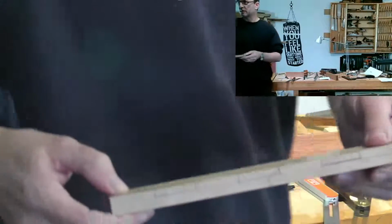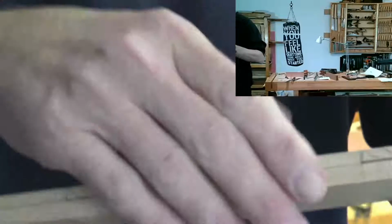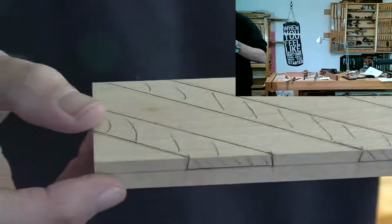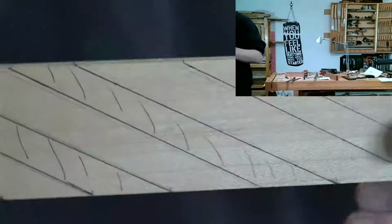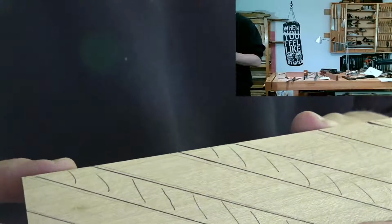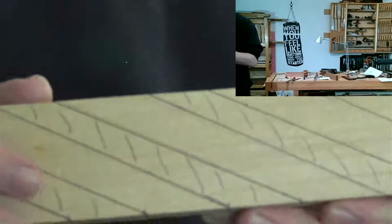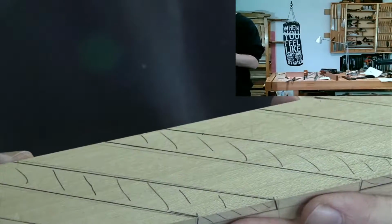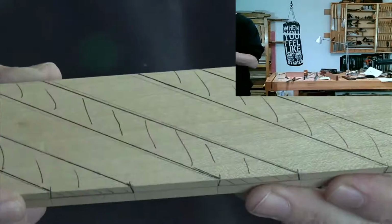Okay, so after all that boredom, here we have dovetails on the one side, going off at an angle through the sole to the other side. They're tapered because if they were perfectly parallel, then pushing the two pieces together, lining all three up together and pushing those with glue in them, a good snug fit would be virtually impossible. So tapering them, it's going to be really easy to put the plane on, move it into position, virtually just sliding on the glue at the bottom before the walls of the dovetails come together tightly.